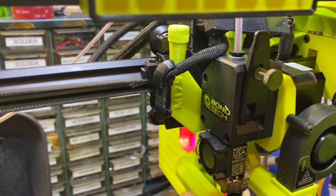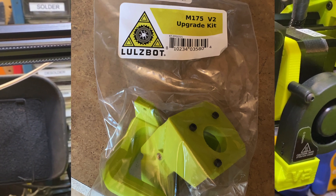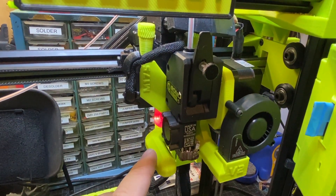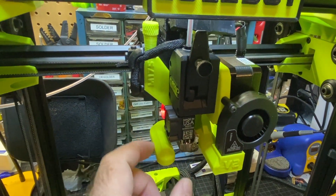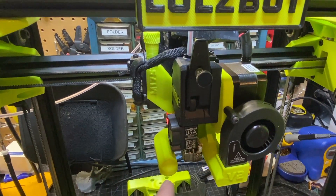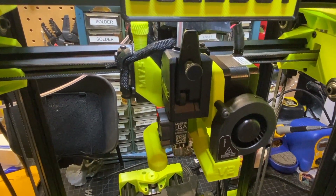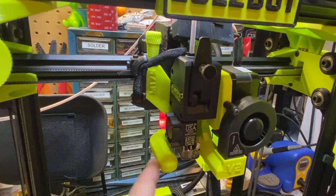I even had to replace the Bondtech Mosquito hot end when they sent me the parts for the M175 piece — it wasn't a big deal. I could have printed it myself, though you also need the right threaded insert, so you need to know what kind to get. After replacing this part, it probably took me maybe 20 to 30 minutes to completely tear this down and redo it. That's not much maintenance at all, especially if you're used to working with a Prusa Mk3 where you might spend an hour just tearing the tool head down and removing zip ties. There are no zip ties at all on this printer, which I think is a really nice thing to not have.